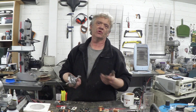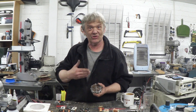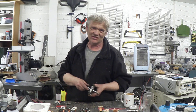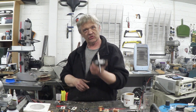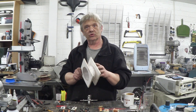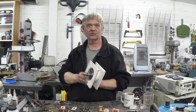We lashed it up in a rough motor configuration and ran it as a brushless motor, which was interesting. But motors are not my big thing — I'm more interested in generation. There was a comment posted: 'Hey, how about making a generator?' This is the generator version. We take the rotor from 1030, and all I've done is put a housing together from builders board (Sintra board) — just a drum, really — and that rotor fits beautifully into the drum, nice and snugly.